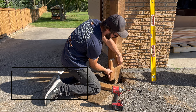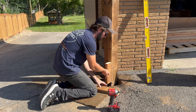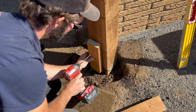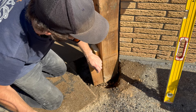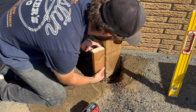When we put our gate on, we're going to have it sit flushed with the six by six because we're going to have the hinges face-mounted directly to both, and it will swing open this way. To get the measurement for the gate, I'll take some scrap blocks, flush it up, and temporarily screw it in here. If you build the gate that tight to the post it would bind up and not close properly, so I'm going to tack it on but leave a slight gap — maybe a quarter inch — so there's room for it to swing.